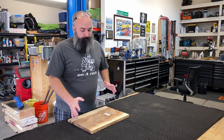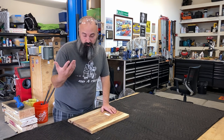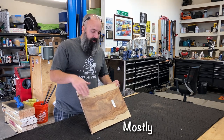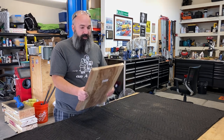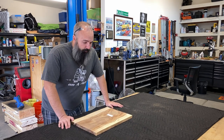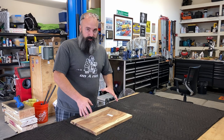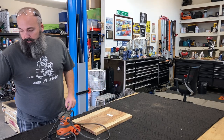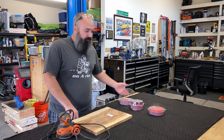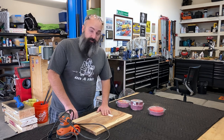For the sake of simplicity, I can't recommend enough using a source like the Woodworker's Source — not sponsored, though if they want to reach out... For a lot of different reasons: one, the dry wood, which is super helpful. This wood is already surfaced, which means it's flat, it's somewhat sanded, and it has a prepped edge — the bark has even been peeled on this side. So there's not a lot of work to do. What I'm going to be doing is sanding it a little further, easing these edges to get it where I want it, and then we'll seal it. We're going to need a sander, some 120, 220, and 320 sandpaper. Usually you only need to go to about 220 — I should have some 150 and 180 in between — but I'm going to make pretty large steps because this is already pretty smooth.